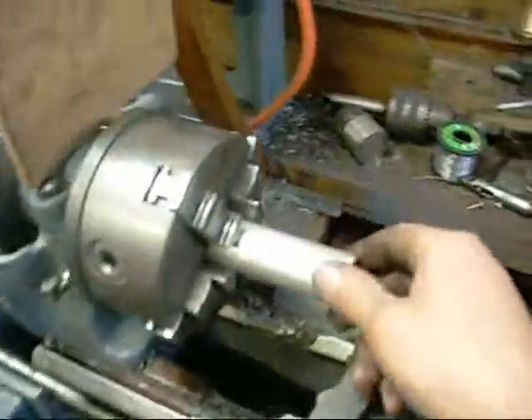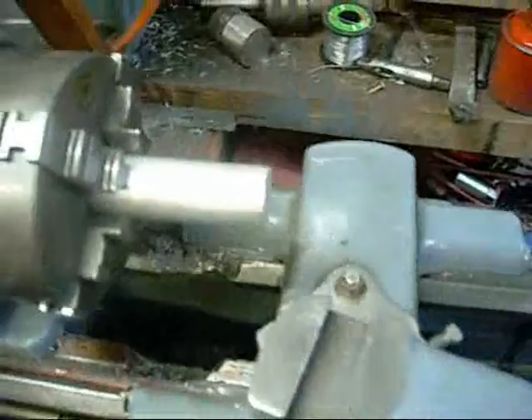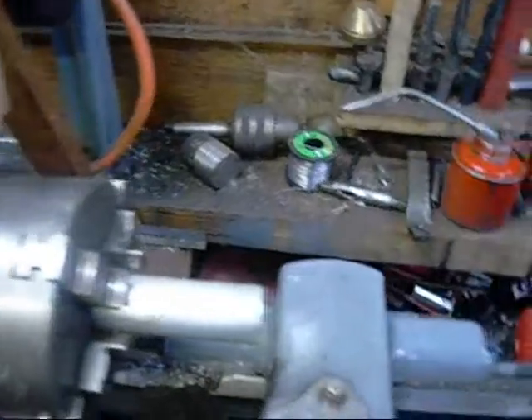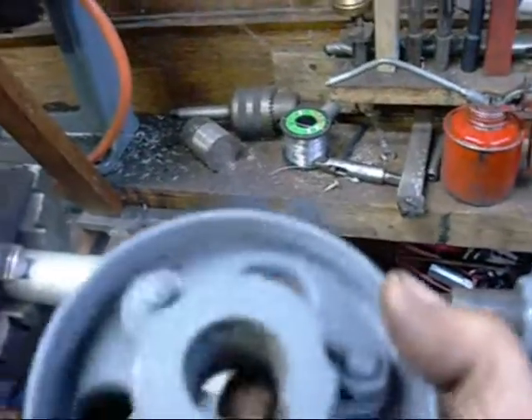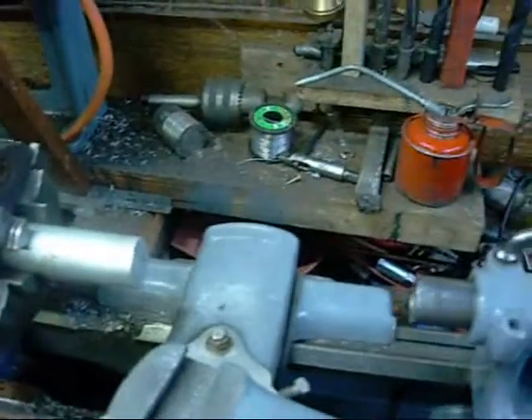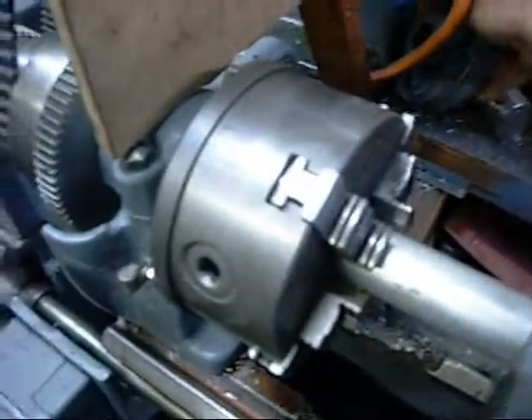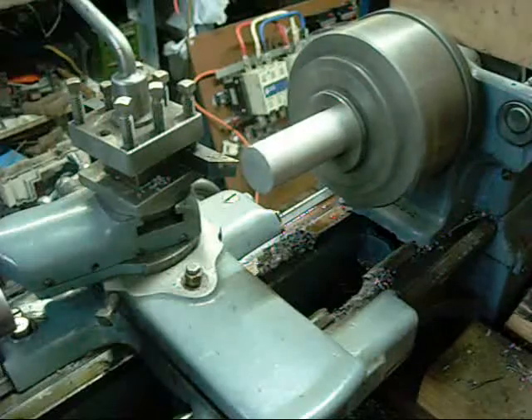Right now I'm just setting up to machine an adapter bush for the other part of the drive yoke. As you can see, it doesn't quite fit. I'm going to use a bit of aluminum bar — actually I might change that to steel just for durability, I've got some steel bar up there. I'll turn the outside down, bore the inside out to suit the shaft size, and maybe cut a couple of shallow keyways in it. I'll see how much material I have to play with — I might not have enough room for keyways, but I really do need one.